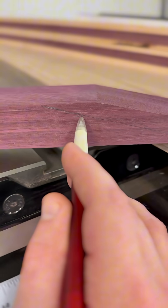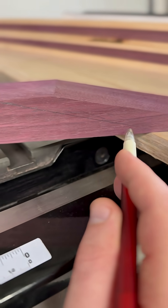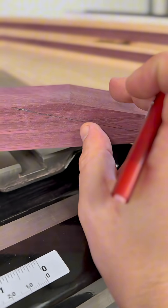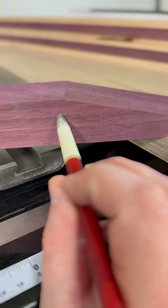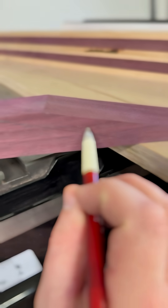This is my first Gibson style build. One of the most common ways that a Gibson neck fails is that the headstock breaks off. If we pretend the headstock starts right here at the angle, this is how Gibson does it out of one piece. You can see the grain here, how it's kind of short along this section — that's where those tend to fail.